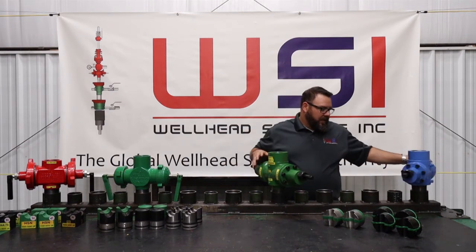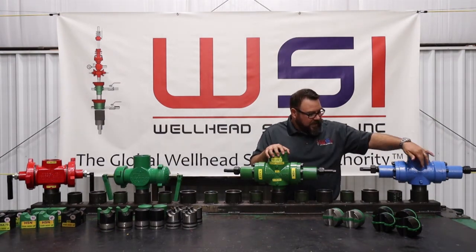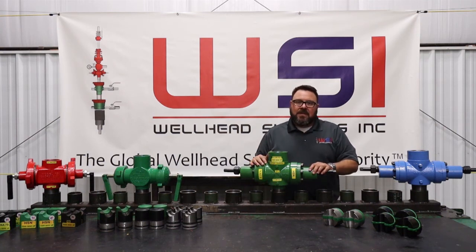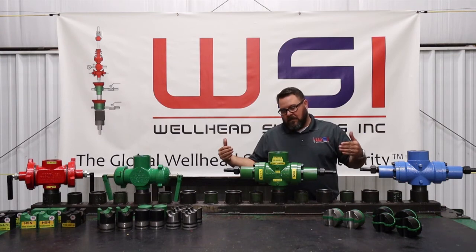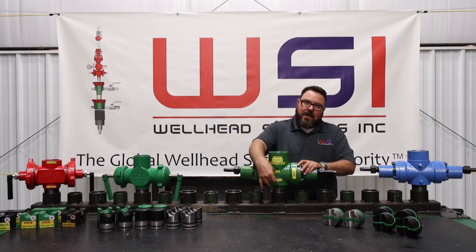Both of them come with ports on the back. If you are installing this below your pump and T, we highly suggest that you run some type of needle valve connection here, because if you shut everything in and you're below your T, you don't have anywhere to release that pressure unless you do something there. A lot of customers like to have their BOP below their pump and T, which is fine, but if you have an operator make a mistake and pressure up the well, you've got to have a way to relieve that pressure. That usually happens when BOP rams are shut in, don't get opened back up, and the unit gets turned back on. You've got to have a way to mitigate that pressure by tying in needle valves to release the pressure below.